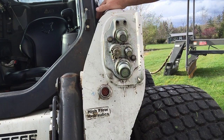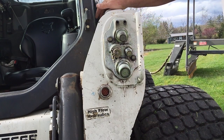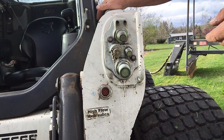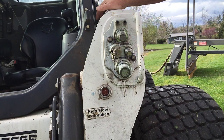This was not a recommended procedure from Bobcat. I actually talked to one of their engineers and they told me it voided the boom warranty. I told them if the booms were that weak, I probably don't want their machines anymore anyway — and if there was a problem, we can take care of it since we do all kinds of welding and fabrication here. I posted it as a little blog about five or six years ago, and customers have told me machines are now coming in with this exactly in place. Dealers have told me they just ignore what Bobcat says and install them this way, because it makes no sense to have a cable running across the top of the boom.